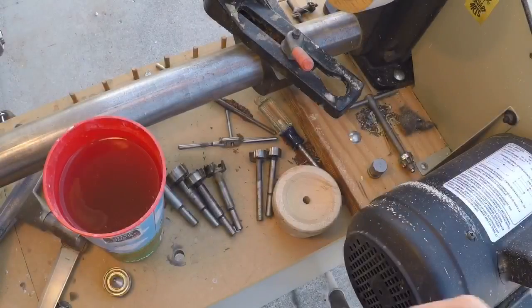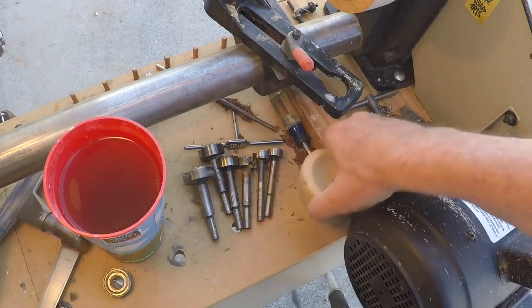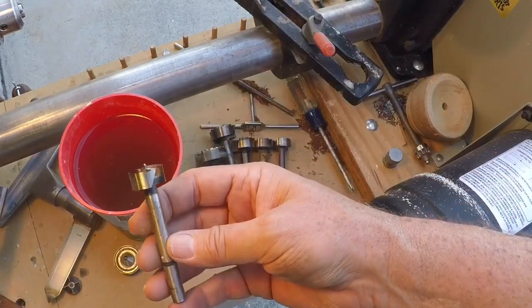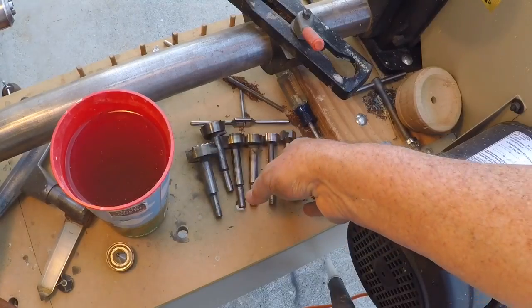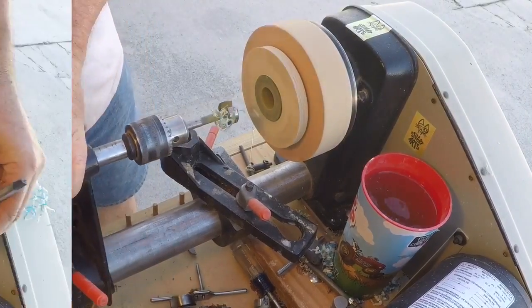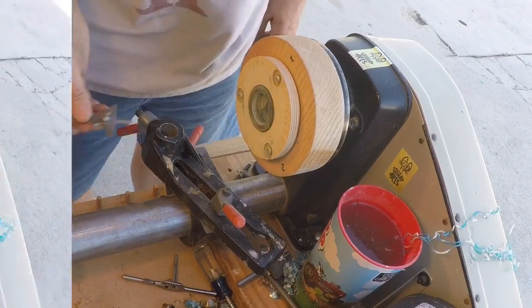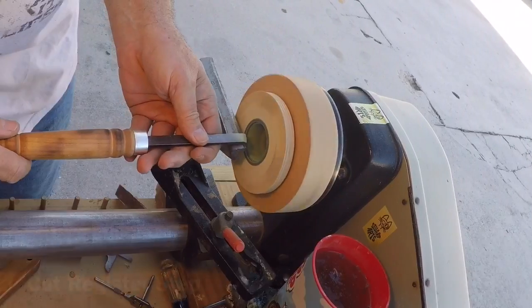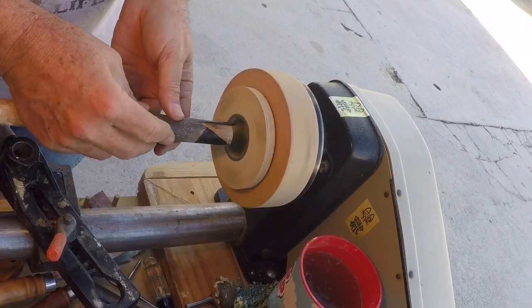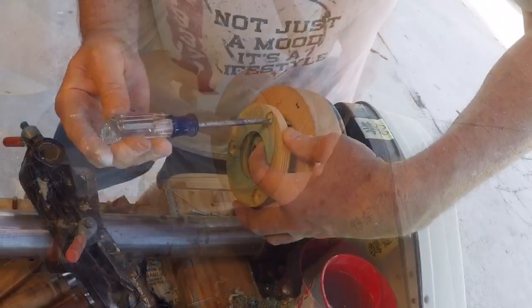Next step is to hollow this thing out. I've got my Forstner bit staged — this will be the final size. What I've learned is you don't want to get in a big hurry or try to get it all out in one go; a lot of heat builds up. I'll be stopping about halfway through each drill pass and quenching the bit so I don't overheat the piece. All bottomed out. To finish the inside, wet sanding works pretty good — I've got a piece of 180 here and I'm just going to take the tool marks out. Oh yeah, it's looking real nice.